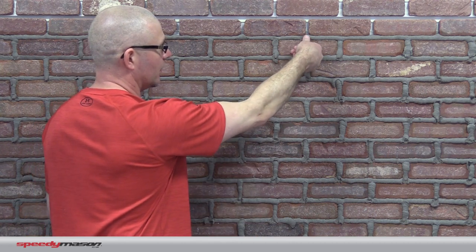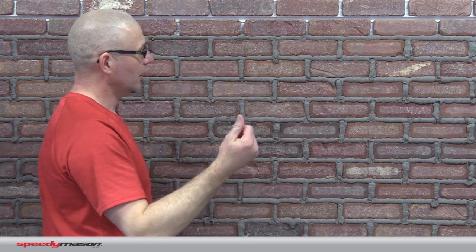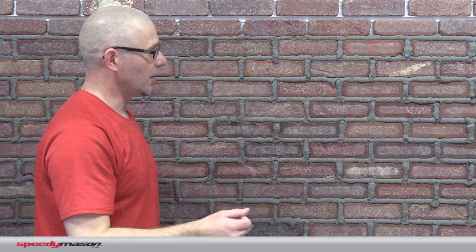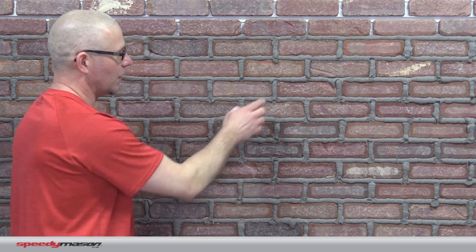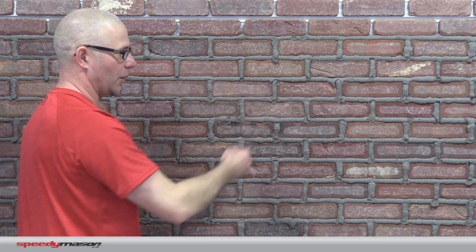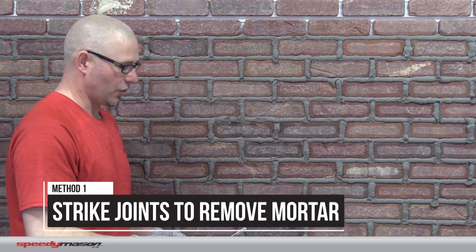If I push it up here — I did this just a minute ago — I actually still have a little bit of mortar on my thumb. What we want is the consistency of what would be wet beach sand. And we don't want to strike it too soon, because if we strike it too soon, that mortar will end up on the face of our brick or on the edges of our brick. It'll be harder to clean off.